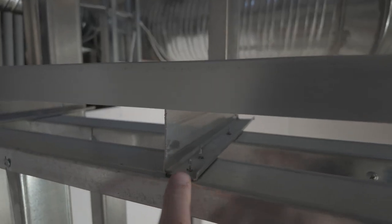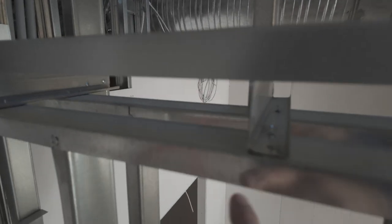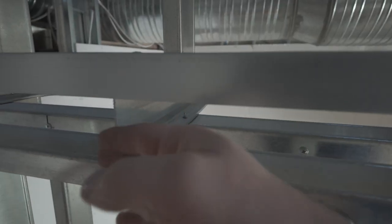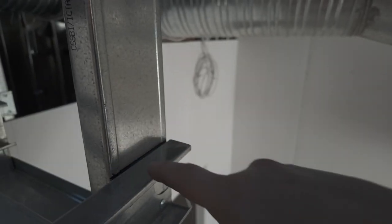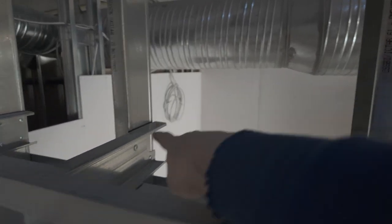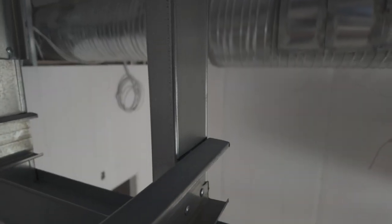I cut all the pieces I need to exactly the right size - basically going from the back of the 3-5/8" right to the front of the double 2-1/2". I have the laser going so I can check while I'm installing. First I shoot the elevation onto this back 3-5/8" wall - I shoot it on every stud and square it across. That way all I have to do is make sure each piece is on that line, and check how close they come out to the front.